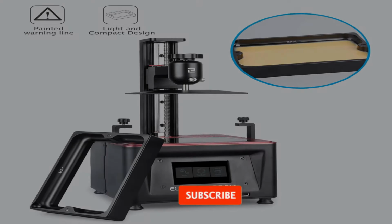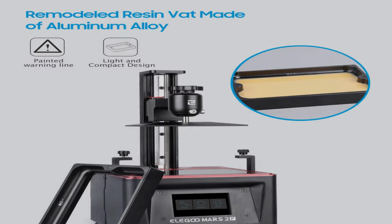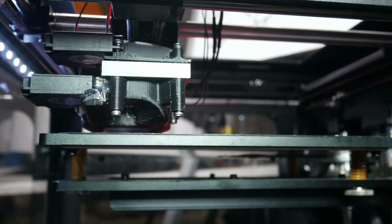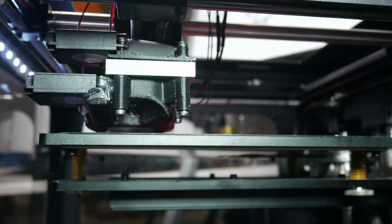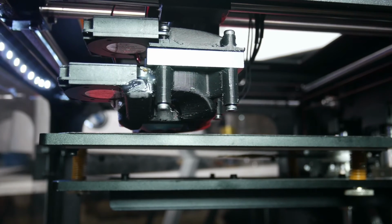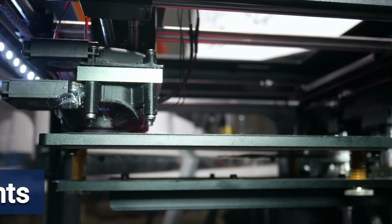For the resin tank, there's a slight recess in the housing. This makes it easy to align and prevents it from slipping. However, you should do this only after you have aligned and leveled the printing plate. Aside from this feature, the print bed leveling on the Elegoo Mars 2 Pro is very simple, accurate, and continuous. Once you have properly leveled the print bed, you can use it to make multiple prints in a row